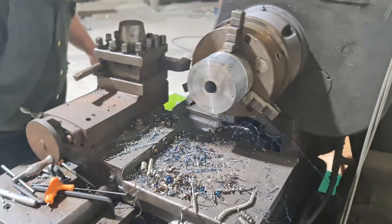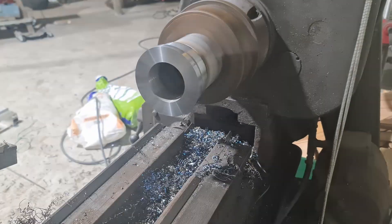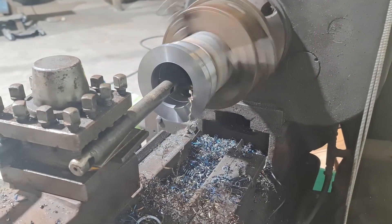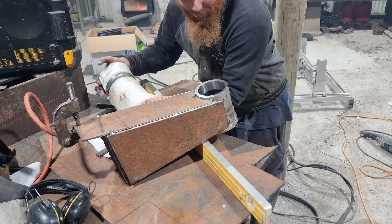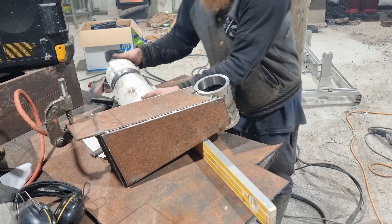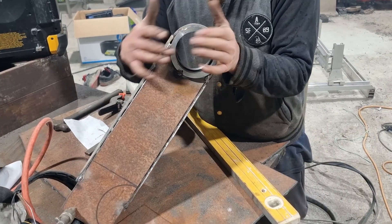I accidentally dropped the camera. After that big hole was bored, I turned the face and the side off, then came in with the big boring bar. So we've got it all tacked up — this is going to be the spindle housing. I've machined this housing here.